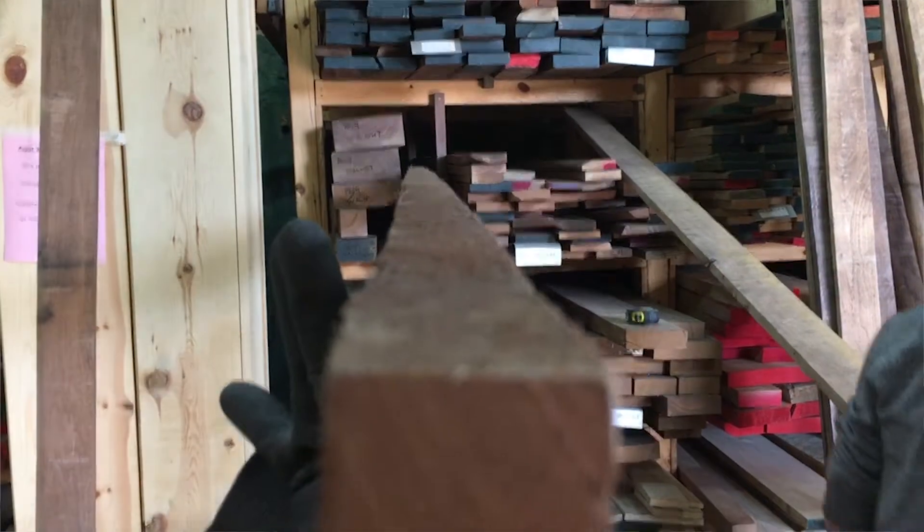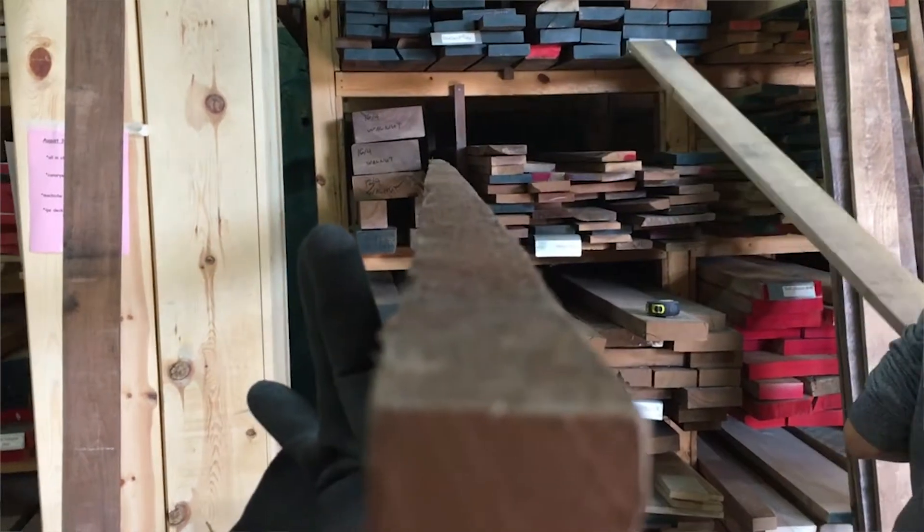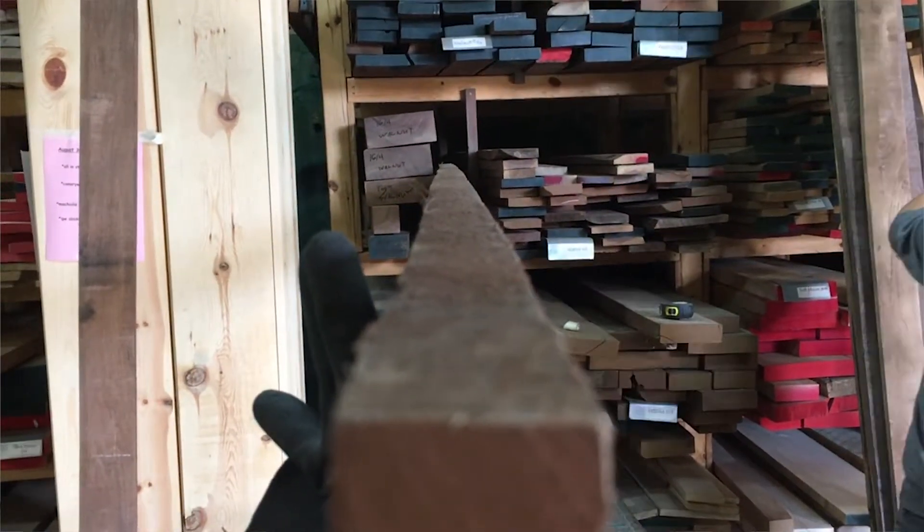Lastly, let's talk about sizing. When ordering lumber, they normally count in quarters — quarters of an inch. So a two-inch thick board is an eight-quarter board, and a one-inch thick board is a four-quarter board, and so on. When you purchase lumber it's normally charged by the board foot, and you can calculate this by measuring the boards you've selected and plugging it into the formula.